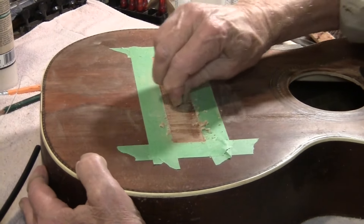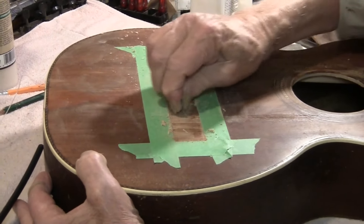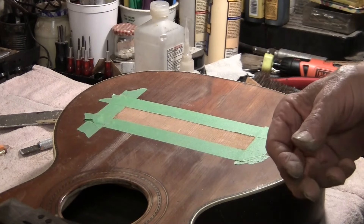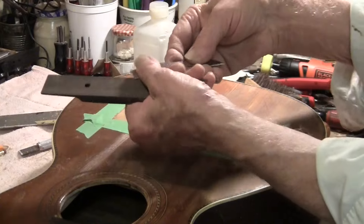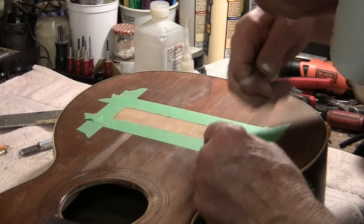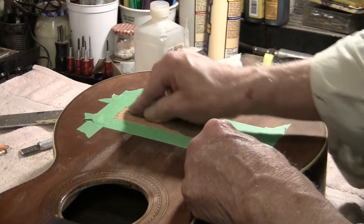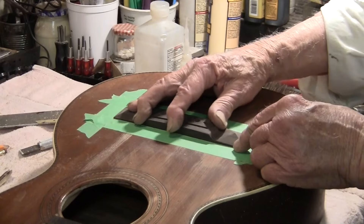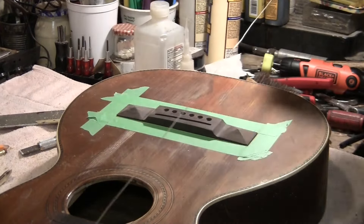I want to make sure to get the finish off. I've roughened the surface with very coarse 60-grit, going cross grain mostly. It really helps to level out. And the tape is very helpful — it just really likes where it is.